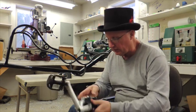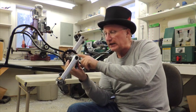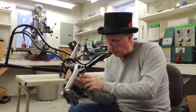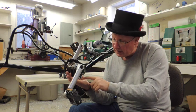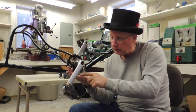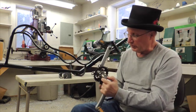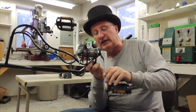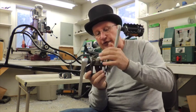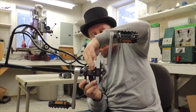Now, once you get that piece of steel, you can lay your bottom bracket shell in it, put it on the framework and bring it down until it hits on the frame, then mark it and you'll know where to drill your holes in the bottom to bolt it into place. Once you get all that, I put it right on the bike and get it exactly where I want it so that this side is far enough over so my sprocket clears the frame.